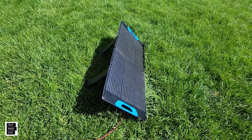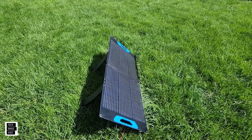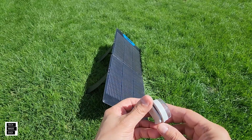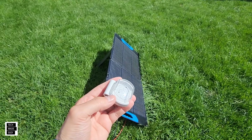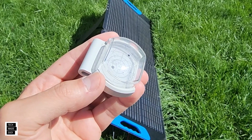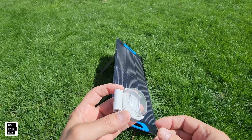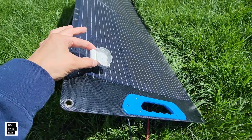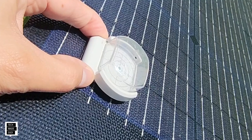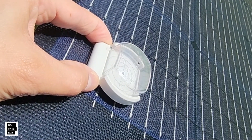Here's the solar panel, and you want to make sure you have it angled correctly to get as much power from the sun. I use this solar angle guide — I swear by it. It's so simple; you don't even need to mount it. There's a dot in the front that creates a shadow. The goal is to get that shadow in the center of the target. I'll put this on the panel and zoom in — and that is spot on. That's going to give me the maximum amount of wattage, assuming clouds and stuff.